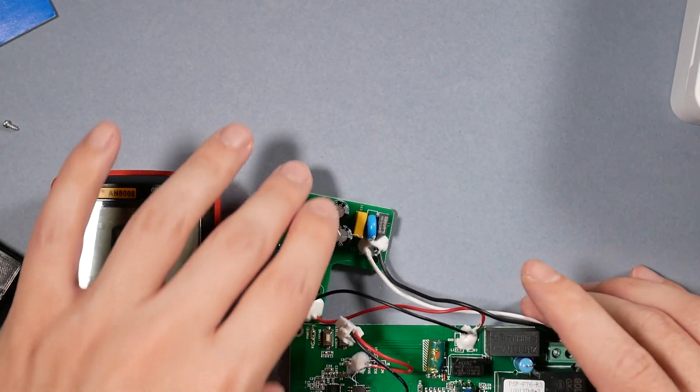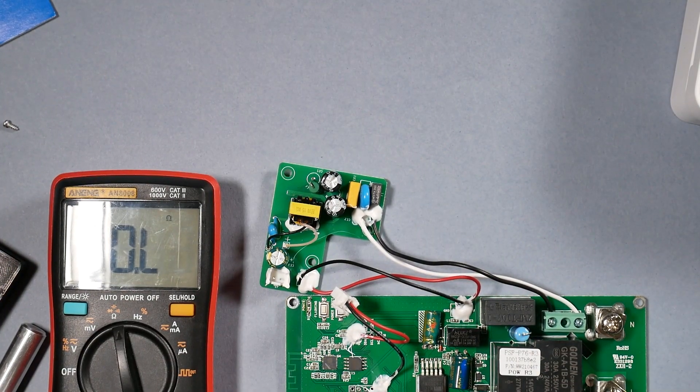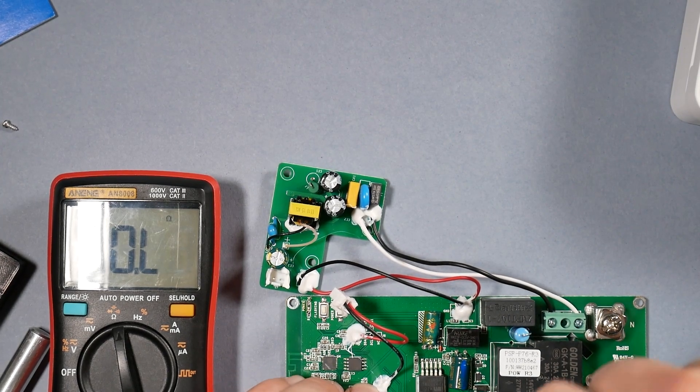There are two PCBs: the small one is a transformer that takes mains power and steps it down to 5V and 3.3V to power the relay and the ESP respectively. As a bit of trivia, underneath the Sonoff Pow R3 sticker there was actually a different name — I probably ended up with an early prototype unit, and the PCB actually says it's a custom Sonoff Pow R2 made by Oyo. So whoever Oyo is, thanks for making that happen.